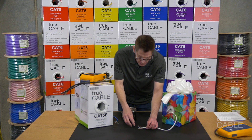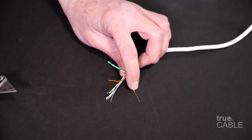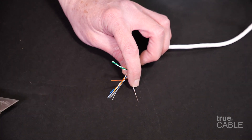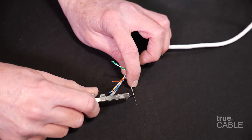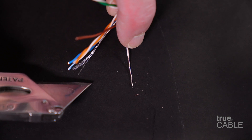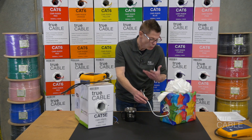There's another way of telling. In the case of copper clad aluminum, all you have to do is get out a knife and start scraping. If you can scrape off the copper and see a silverish material underneath, that's aluminum — hence copper clad aluminum. You can easily spot it because of a color change: you go from copper and then scrape right down to aluminum. That's not what you want to see.